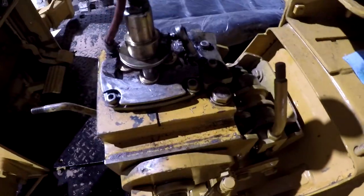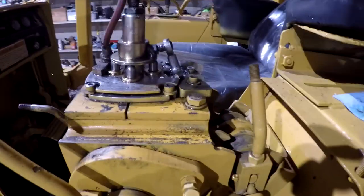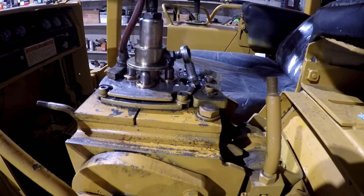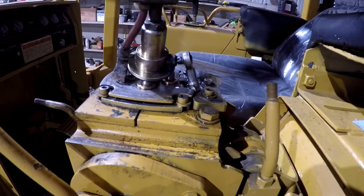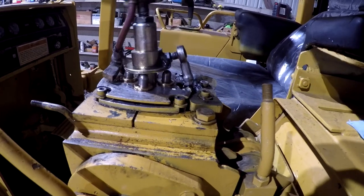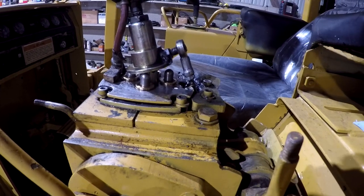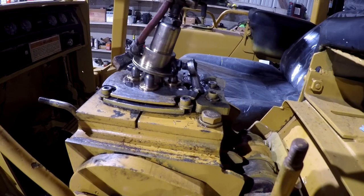All right, guys, I believe we got her fixed up there. You see how I welded the nut on there at an angle, just tacked it on there so that when I go in reverse, we get full movement of that joint right there. Works that way, side to side, left, right, all that good stuff. And as I say, the purpose of that is you're supposed to be able to mash this lock right here like that, and it holds the joystick wherever you put it.